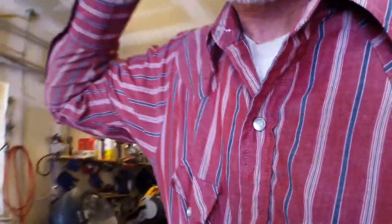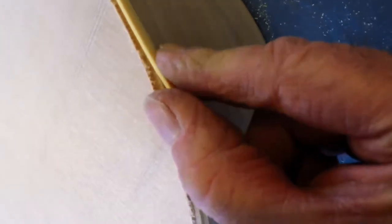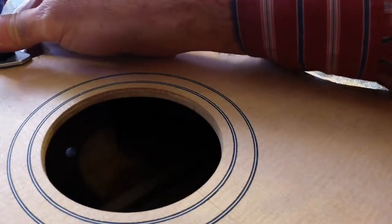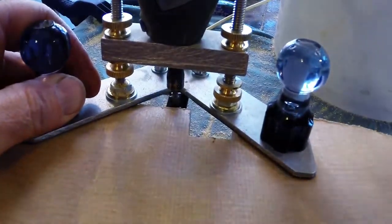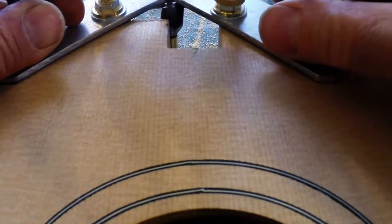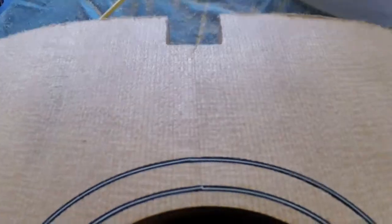They cut so little off — it's just a matter of a difference in the sound. You can see it's a little bit deeper, a little bit nicer. If you're doing a sharp edge horn of a guitar and you roll up to the edge of the horn, you can see that bearing. You start to see the bearing down there on that edge, so you just follow through. Just continue on like that. Don't try to come around the corner. Keep it simple — don't try to do too much in one shot because you'll end up screwing up.